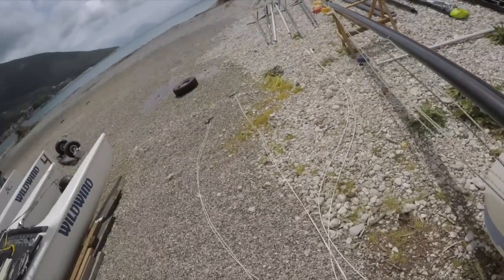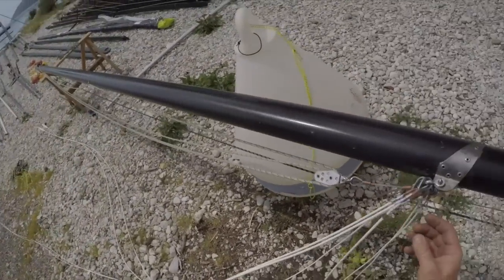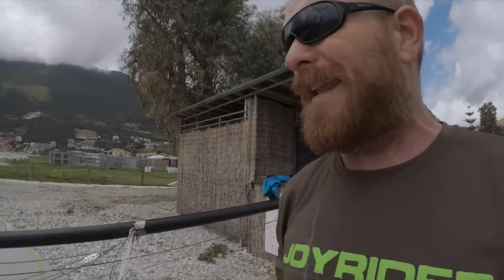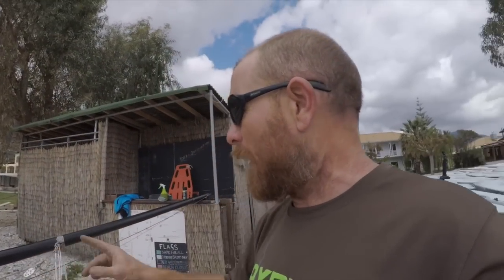All that's left is I'm going to tidy up the wires. Because I've got a lot of boats to do, I'm not going to put the chain plates back on or the trapeze adjusters now - I'm going to do that when I come to put the mast on the boat. For now I'm just going to tidy the wires up to make sure they're not going to get in a mess when I move the mast. Hope this has been interesting, informative and useful. It is a very good idea to replace your rigging occasionally to prevent your mast from coming down, because if you're sailing somewhere without safety cover and your mast comes down, you could be in a really bad situation. Make sure your rigging is in good condition - I'd say that is the most important thing to check with your boat, and of course the bungs. Thanks very much.